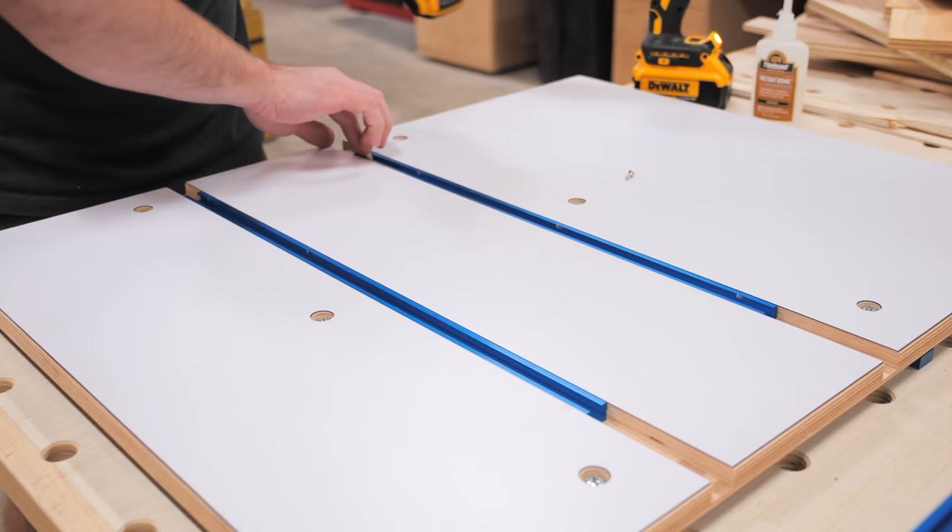As you can see, I forgot to add more screws to the underside of the fence, which helps secure the base to the fence and keeps the fence straight over time. With the fence dialed in I could start adding accessories to the sled, starting with a block to cover the area where the blade exits the back side of the sled. I cut four small pieces of plywood using the sled, glued them together to form the block, and while that glue dried I continued by adding the tape measure to the double t-track. The tape measure kit from Rockler includes a plastic insert which the tape measure adheres to — this insert fits into the t-track. It was an extremely snug fit, but I eventually figured out that cutting the piece in half and sliding it in from both ends made the process a lot easier by reducing friction.